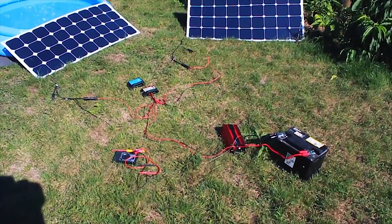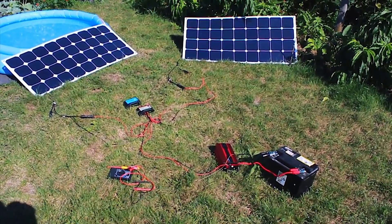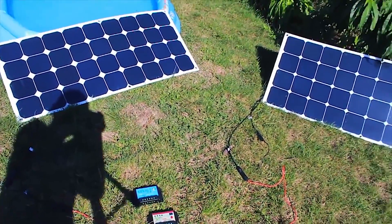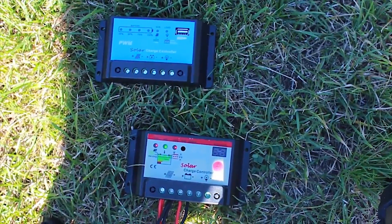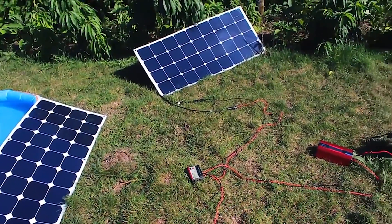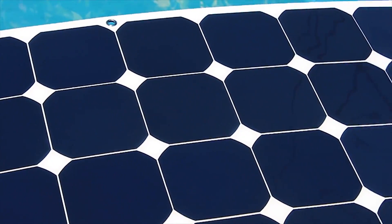A few words on correct placement of the solar panels. They need to be placed in wide clear areas and must face south for best efficiency. The preferred angle is 45 degrees based on the horizon. Of course, the setup can be modified and optimized, or you could even install an automatic rotation system so the panel can catch as much sun as possible throughout the day.